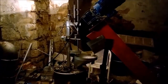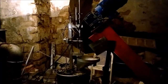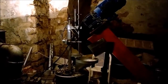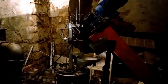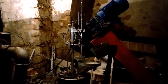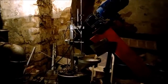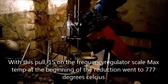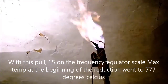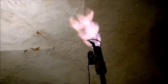One and a half hours burning time now. We have reached 770 degrees Celsius inside the gasifier. I still have not started the filter yet — I want first to see what the maximum temperature it can reach. The flare is going all the time, sort of blue-violet.